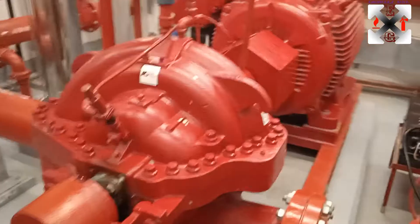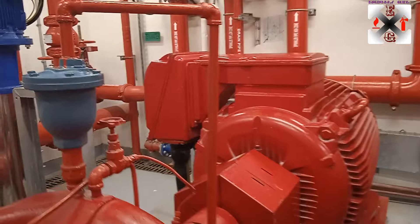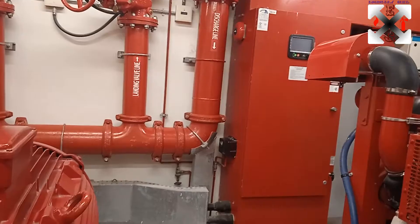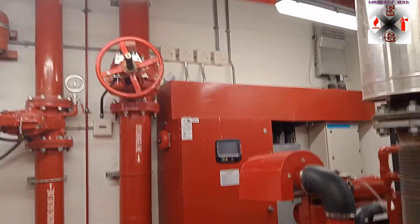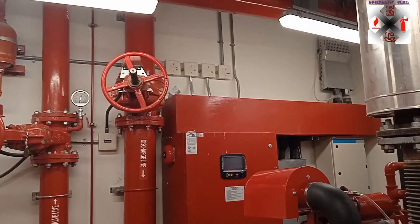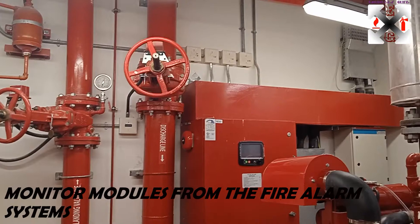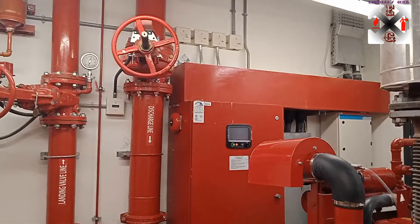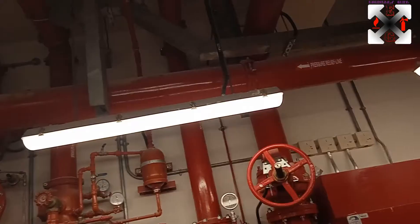This pump is controlled by an electric motor, which is connected to the electric fire pump controller and supplied with power from the supply box on top — it's covered nicely. On top of it is the monitor module that monitors the system. In case there is any pump run or trouble in the system, the module will alert, since there is nobody standing by inside the pump room.